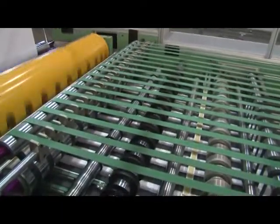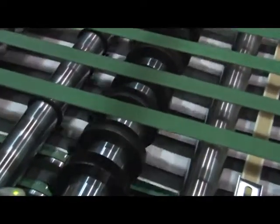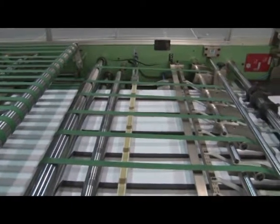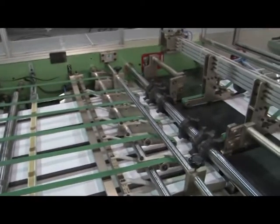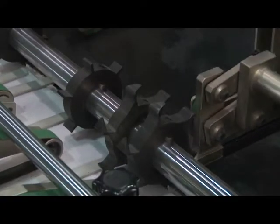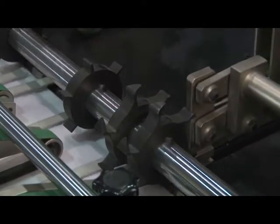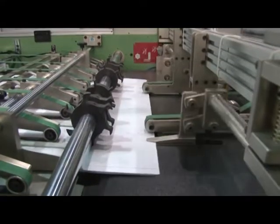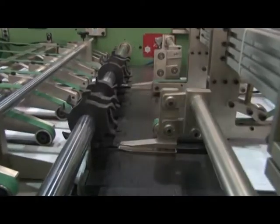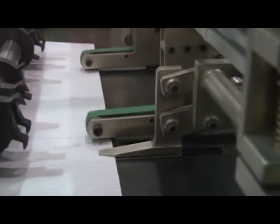After accurately sheeting of the paper, it passes through the conveyor unit which is provided with an overlapping system to control the speed of the paper. The automatic sheet counting unit counts the sheets by encoder, and the collating unit collates the bunch of counted sheets controlled by servo motor. By the touch screen on panel, this unit is also provided with a robot system to pick up the counted sheet bunch from the separator and place it on the conveyor table for further process.